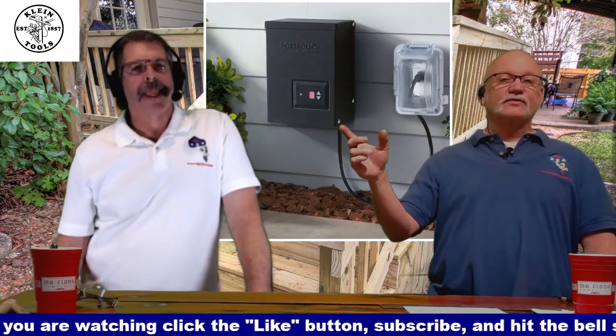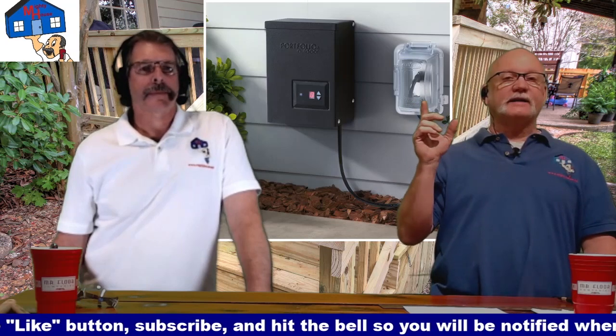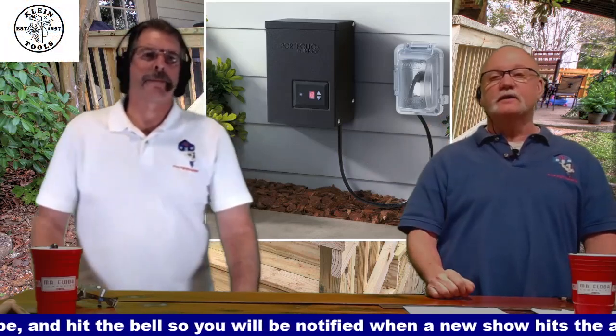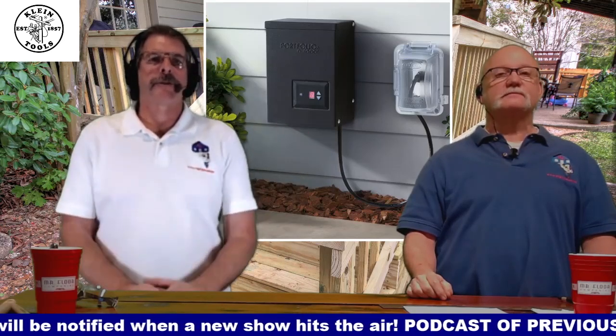You can do a transformer like this, plug it in, flip the switch, the outlet turns on and off you go. You can have a timer on it inside with your smart home — the Lutron system — and wire it up like that. All my outside lights come on 20 minutes after sunset. Sunset changes every day by seven and a half, eight minutes, so I don't have to mess with the clock. It goes by the internet. My front porch lights turn off at 11 so I don't drive the neighbors nuts. Driveway lights stay on all night but I cut them to 50%. You set all those scenes — the Lutron outlet stuff is awesome.